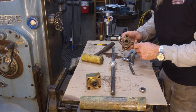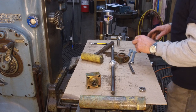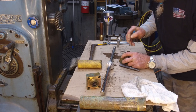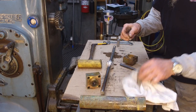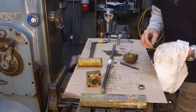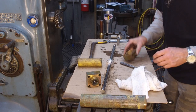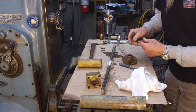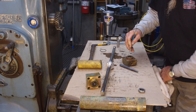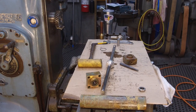All right, so we're going to get a scribe and pull a few of these things out. But I bet I can probably get all of these through McMaster-Carr right there in New Jersey. Okay, these outside O-rings. Well, it's nice. We can measure the bore and the width of the O-ring and the root of this here, and we can pretty well figure out what size O-rings we want and figure out the numbers for those through the book. And okay, we're going to pull out the wiper now. The wiper's on the outside. We can go find the wiper.